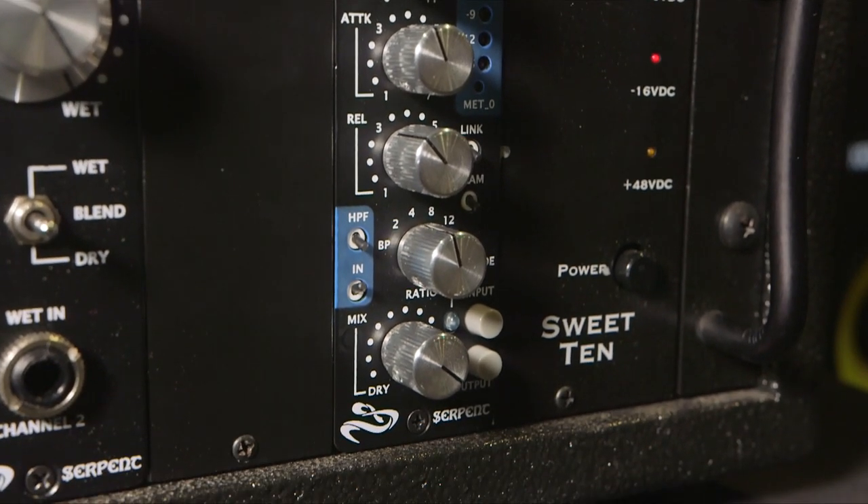How does slam mode work — are you not then limiting it? When you engage slam mode, it's treating the circuitry the same way, but the compression circuitry is different. So you can switch the ratio anywhere you'd like — you can even bypass it and go to a one-to-one ratio and use it strictly as a color box, using the mix knob to blend that to taste. Or you can go to two-to-one, four-to-one, or twenty-to-one, whatever fits the application, and blend the all-buttons-in mode characteristics with the compression style of your choice.